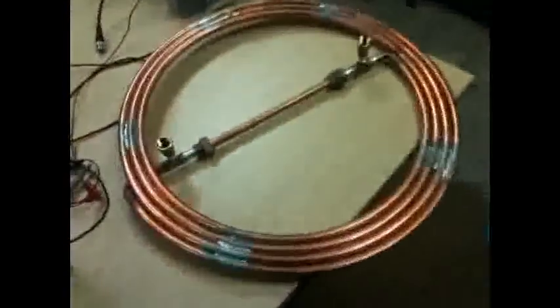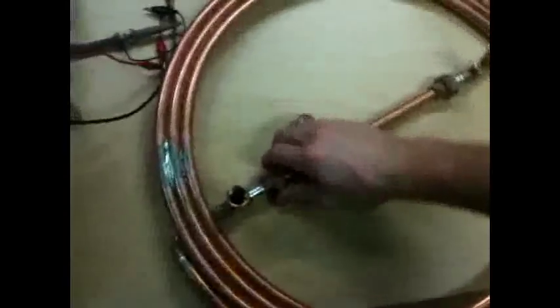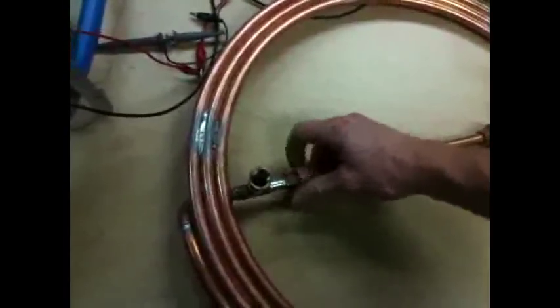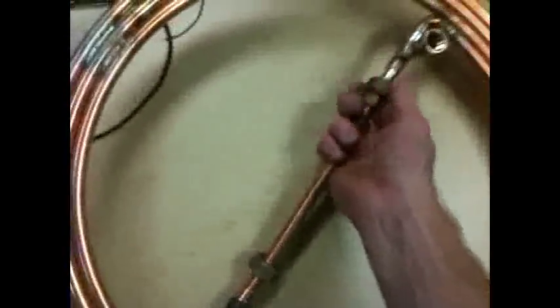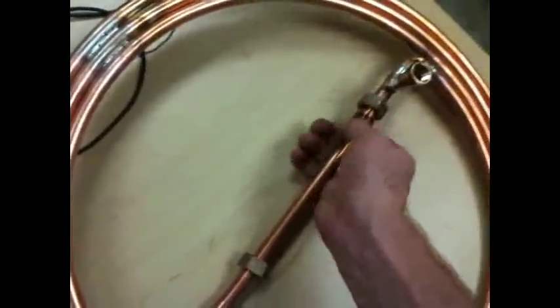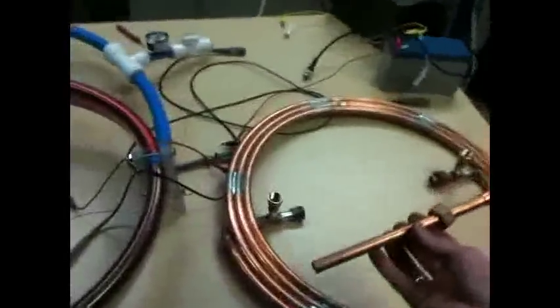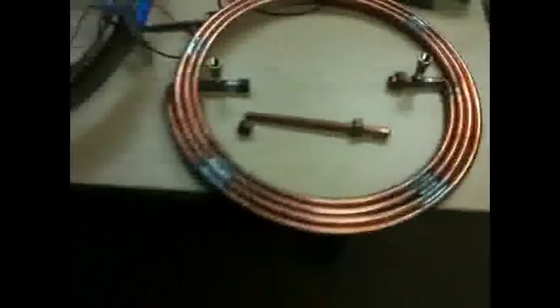So I'm going to set it up here for you. I've got to solder a couple more connections for the center. Here it is — this is the Stan Meyer EPG replication right here. This pipe comes right off here and I'll be able to slide my coil pack on here, which I still have to make. Progress just didn't go the way I liked it, so I decided to break down and buy the copper. I really have this feeling that there's something with this copper. So there's my centerpiece — this comes out, and that's the piece I don't have soldered on yet. I'm going to do a little pressure testing to make sure this is all good. This is the only piece I have left to solder — I ran out of solder. The solder joints look pretty good, not the best, but not that bad.